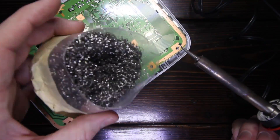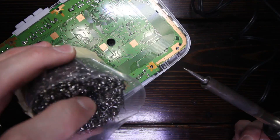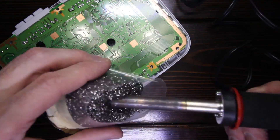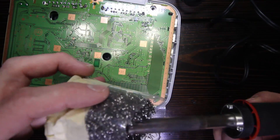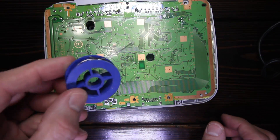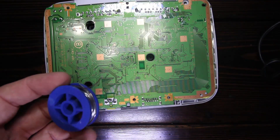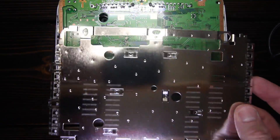Here's a fun little tool: I've just got a bottle that I cut off and threw a Brillo pad in. You need something to clean the solder off your soldering iron — they make specific tools for this, but it's not something you need to spend money on because it's pretty easy to make your own. I'm also a big fan of lead-based solder because it just works better — it melts better, it sticks better. But it is toxic, so you don't want to breathe in those fumes. Let's put this thing back together and see how we did.